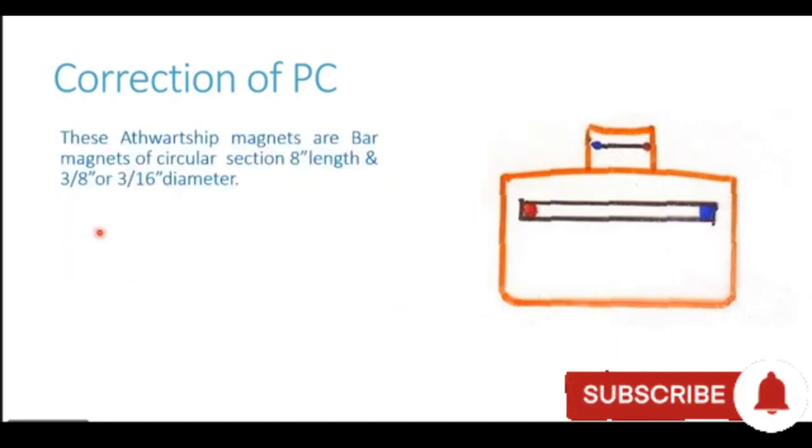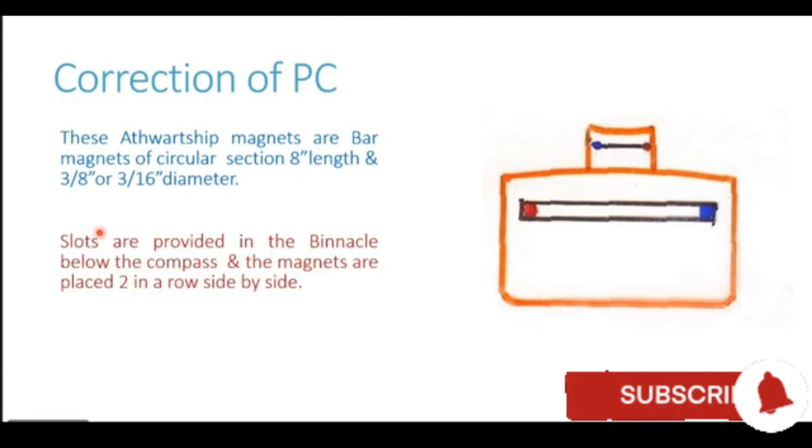The magnets which are used for correction are exactly similar to the ones which were used for correcting permanent B. So these athwartship magnets are bar magnets of circular cross section, which are 8 inches long and having 3 by 8 inch or 3 by 16 inch diameters. Two thicknesses are usually provided by the compass makers. In case a powerful magnet is required, then we will be using the 3 by 8 inch configuration. And in case we need a not very powerful magnet, a 3 by 16 inch diameter magnet can be used.